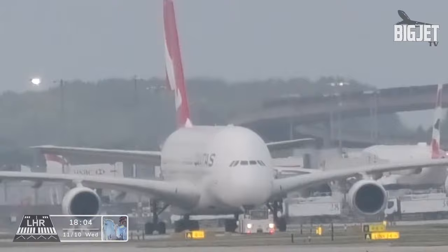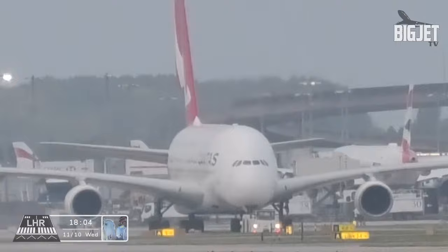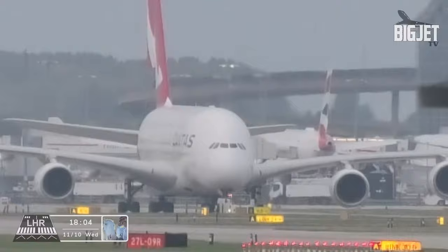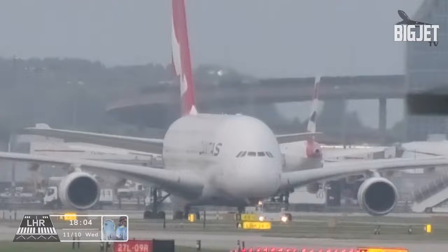Split rudder assembly on the A380. That is for a couple of reasons, but one of the reasons is for stress on the mechanisms and on the tailplane structure itself, the vertical stabilizers. See the elevators dipped below their neutral position, which indicates that there is no hydraulic pressure in the system, so they just drop to their neutral position.